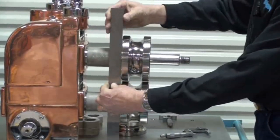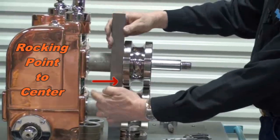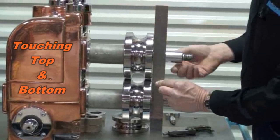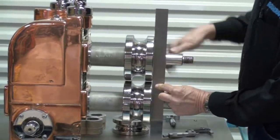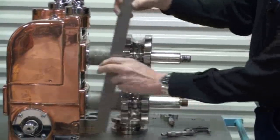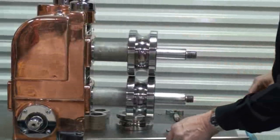When we go to both sides like this we can see we have some rock on this side, meaning we're touching on the two inside edges. Over here we're touching the top and bottom, which means the top shaft is not parallel with the bottom. If we make the individual adjustment with the outboard tower to make sure the shaft is parallel, we can now get an even reading on both sides.